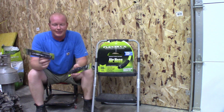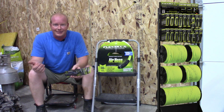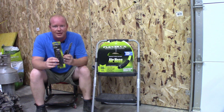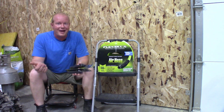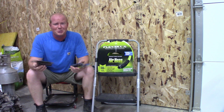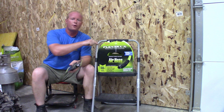So the guys at Flexzilla and Legacy, they really got this thing figured out. You can actually go and buy air hose in bulk up to 1,000-foot length. So you can buy 25 feet, 30, 35, 40, whatever you need, you can buy it in bulk, and then you can use these 1/2-inch or 3/8, whatever size hose you're using, fittings to repair that. Or if you accidentally cut or rip this hose, you can buy these repair fittings to be able to properly repair the air line without using one of those stupid barbed fittings and hose clamps that are always going to rip your hands up.